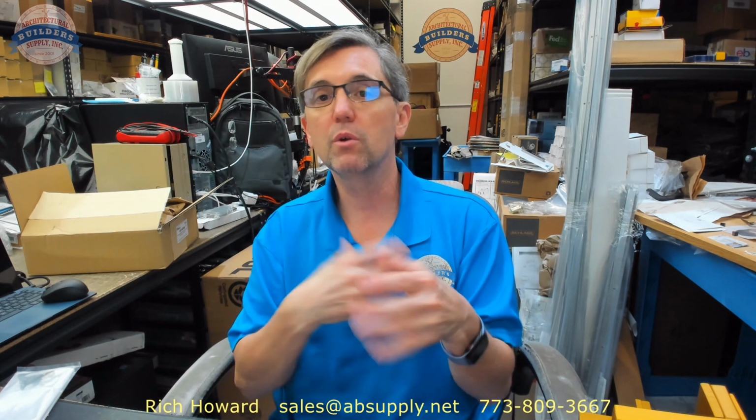Hey, tomorrow is Saturday. It's Friday morning. Tomorrow is Saturday, and I've got to prep 10 doors for flush bolts. Okay. Which flush bolt? FB41's great. Do you have the template guide? Yeah, I've got all of those. I've got every size that you need. Well, make sure you've got a 5/8 because you're going to need that. You got any 1/2-inch 2-flute plunge, long plunge router bits? No, but I can go to the tool shop and get one real quick. Well, if you can, I can ship it to you. I keep it in stock.